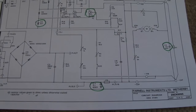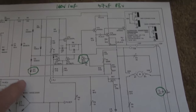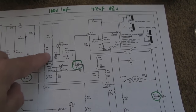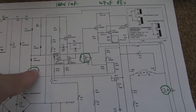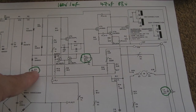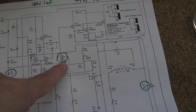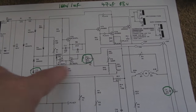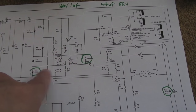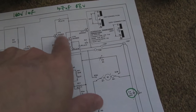I found a diagram — it's not exactly the same, it's for the Mark II, which I think was a dual power output unit. I've circled a couple of components. There are some differences: this unit has only three transistors while the schematic has six. But the parts do correspond — connectivity between components matches up. The Zener Z3 that's gone is apparently a 5.1 volt rated one, and it connects to that transistor that failed, which is exactly what I'm seeing physically on the board.